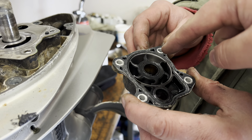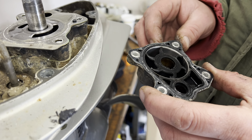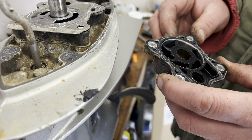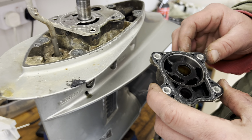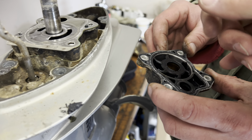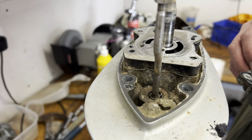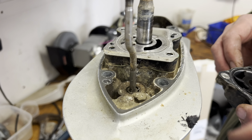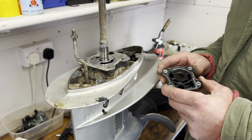There's the old impeller — John actually said this one looks pretty new, but as we've got it off we're just going to change it anyway, just to be on the safe side. In the pack we've got a gasket that runs around the outside and a paper gasket for the inner bit — we've got a new one for that too. We're going to take all the old stuff out, put the new in and put it all back together.